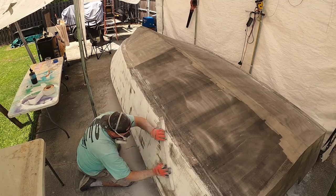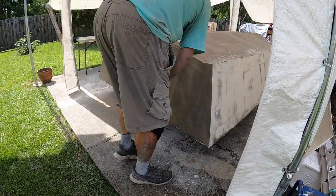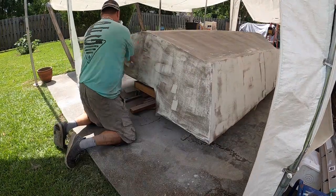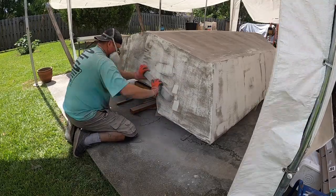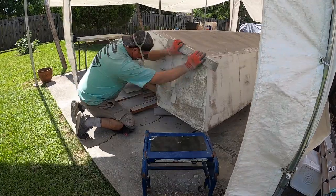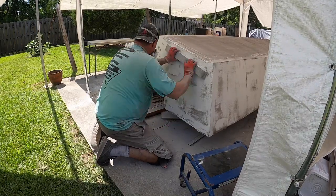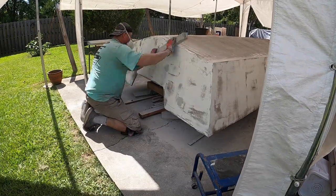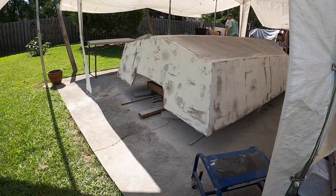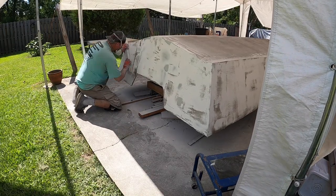Another thing that I've talked about before with this fairing and sanding and everything else is, well, when do you stop? This transom, I think, gives you an idea of how, as I move from right to left, is that enough? What I do is I come back and hit it one time, then come back, change paper, and hit it again. I try and sand it back really well till I start seeing those green pieces of the fairing compound showing through. It's a process I've never done before. I'm learning. Knowing what I know now, I'm really impressed with what happens.